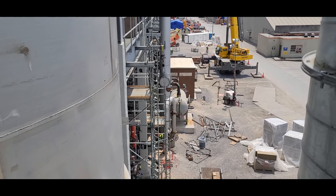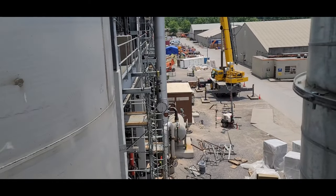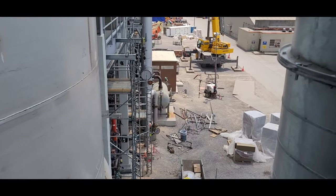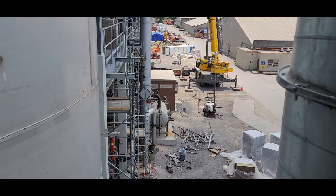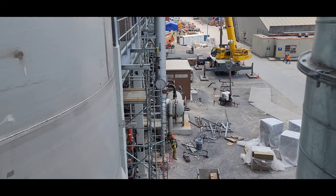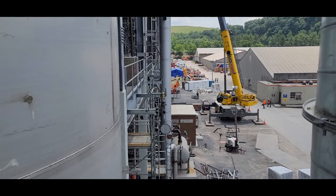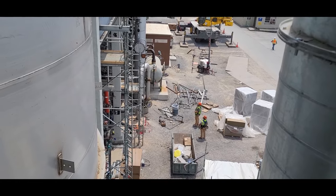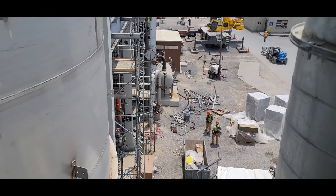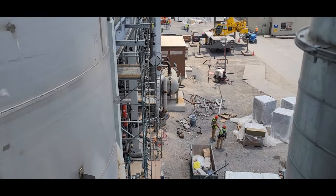As I started putting my quarters in, the pipe started closing up like expected. So I said, you know what, I'm gonna do what I usually do. I'm gonna just rip it. One of the things about ripping pipe is that after you put your four tacks in and you decide to open a gap, you gotta realize what's gonna happen. You're gonna have a dog leg, long story short. A dog leg is like a bow in your pipe, whether it's crown style or bow. Some of you carpenters out there know what I'm talking about, but that's just how the pipe would look.